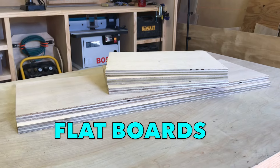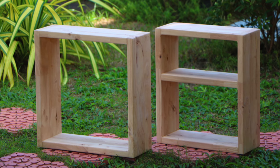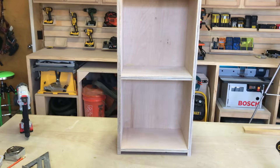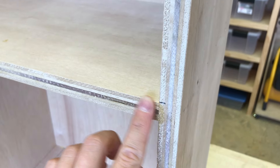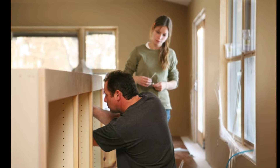We'll start with the problem that most new DIYers eventually run into. Say they want to create a shelf or a set of shelves. Right off the bat, they'll tend to conceive of it only in terms of flat boards — just boards running horizontally that sit on or intersect with vertical boards. A new DIYer will go so far as to build this set of shelves, attach pieces through their ends, and create this sort of box-like structure. They might even cut and attach a back panel of thin plywood. When it's all said and done, if they've used the right fasteners and techniques, they'll have a functional little set of shelves. But the problem is it still won't quite look right — it looks kind of thin and spare. And if they've used plywood or MDF, they'll have these ugly exposed edges. Most people don't want that in their projects, at least not by accident.